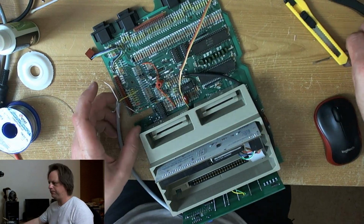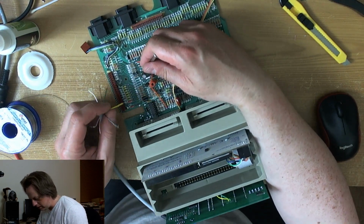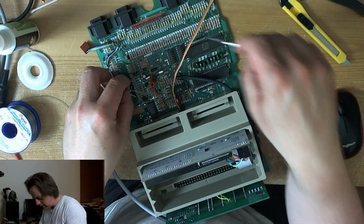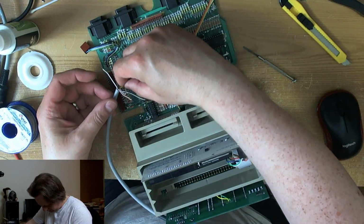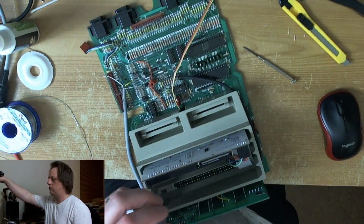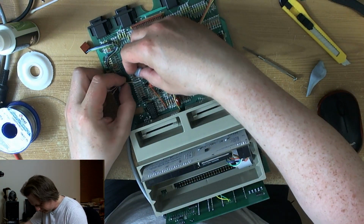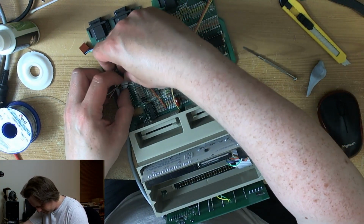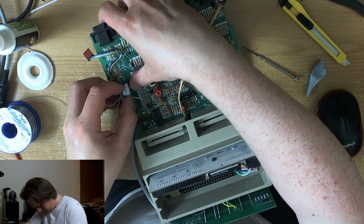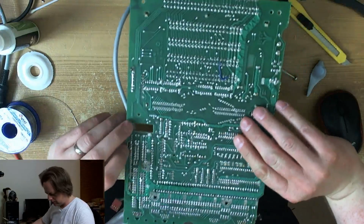end. You're not going to put it at this end, because if you put it to this side of the coil, we're just going to hook composite video up to the original composite video circuit, so we're going to put it at the far end of the coil, where the coil used to be, and we're going to use our patented blue tack wire restraining technology. Nobody else is allowed to use this idea. We'll use it to keep that wire in place until we solder it.